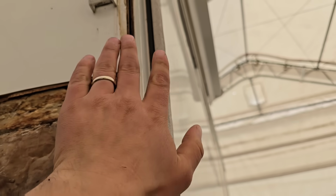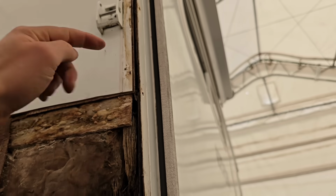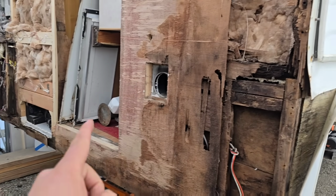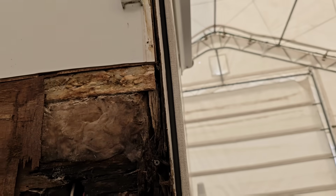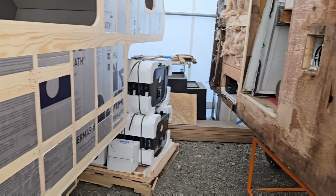Then the only thing that is getting relied on to seal this is a rail over the corner screwed in, with, hopefully, this little sealant line is going to do it. No, because there's bad friction joints all over this thing, the thing moves and tweaks and breaks itself apart right here at the corners. All of these pull themselves apart, and then the fate of the unit is sealed before it left the production facility. That's just how it is.